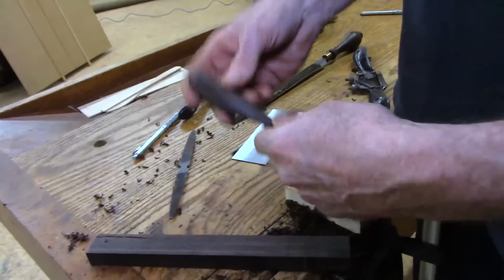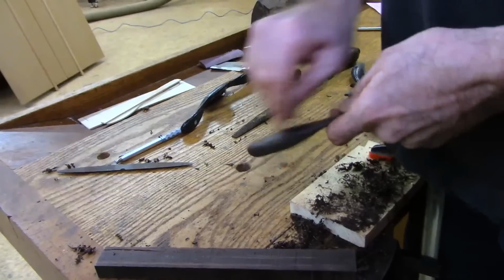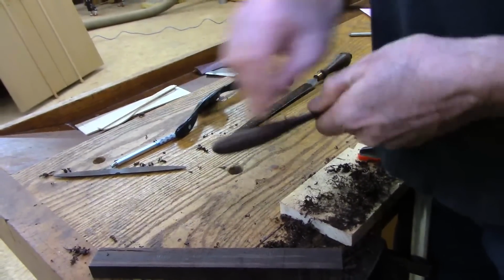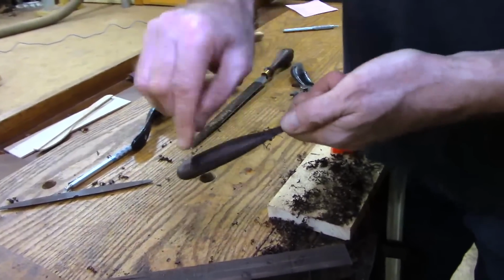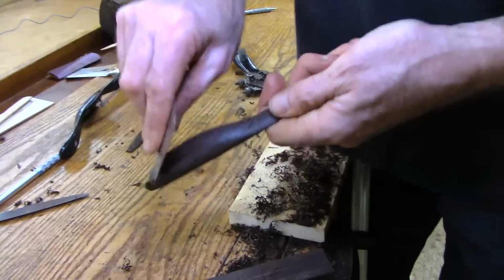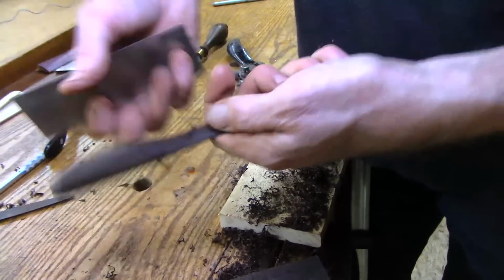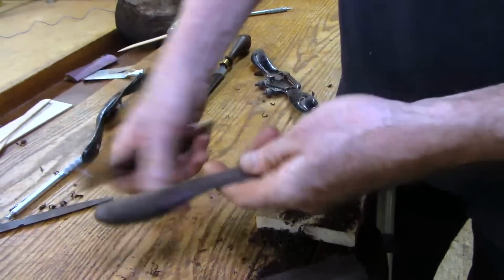Now, once I would get it to this point, I would go around and make sure I got rid of all my bandsaw edges, and I like just going around and tuning it up this way with a good card scraper. Just keep moving it. A sharp card scraper makes for pleasant work. You want that transition to be smooth and nice. We're getting close right there.